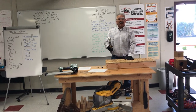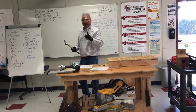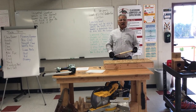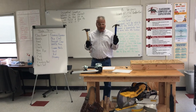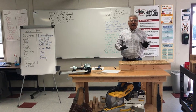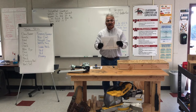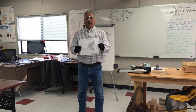Notice how it's hitting it. Now, if I were to hit it sideways, what would happen to my arm? My arm will get tired and I'll probably get hurt. So hitting the nail correctly — the correct form — is what you want to do. And that is the two hammers: the 16-ounce and the 23-ounce claw hammer. You're going to go to your stations and practice using the two hammers and driving the nails. I'll also give you a handout with the nails, so make sure you understand this because you have a test on Wednesday. If you have any questions, you may go to work. Thank you.